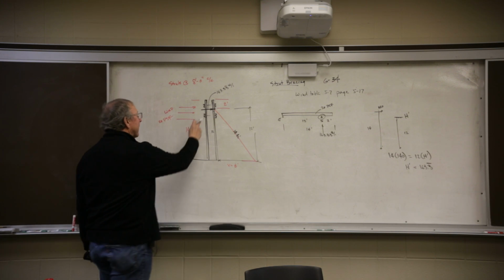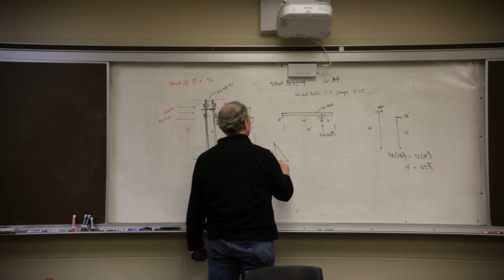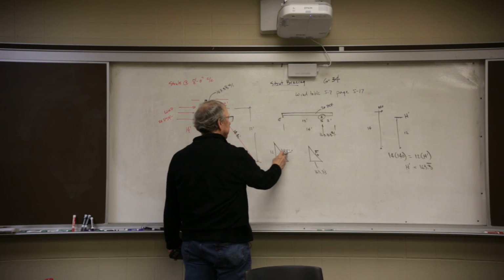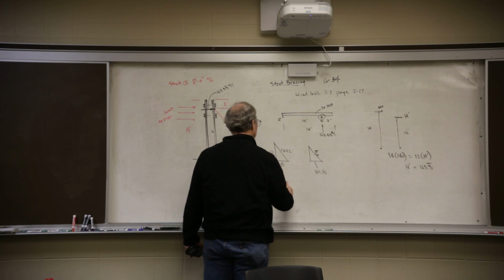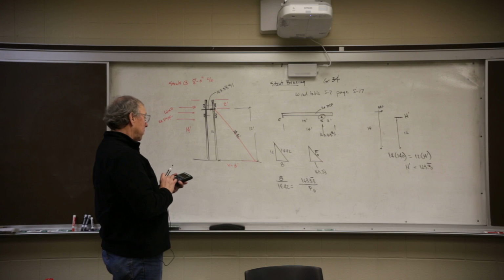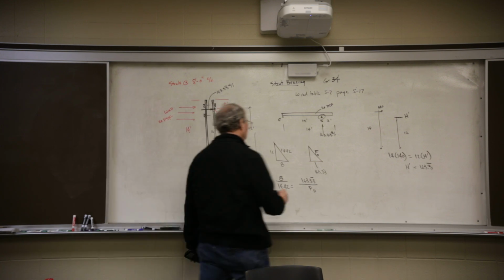Okay, I've got a horizontal of 163. So if this is the case, 12, 8, 14.42, 163.33, force in the diagonal. This is to that as that is to that. 8 is to 14.42 as 163.33 is to the force on the diagonal. So if I take 14.42, multiply it by 163 and a bunch of threes, and divide it by 8, I get 294.41.